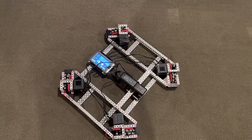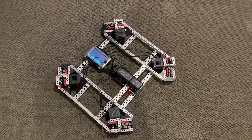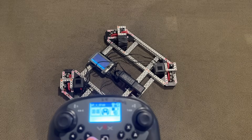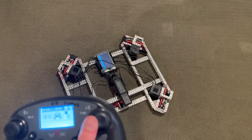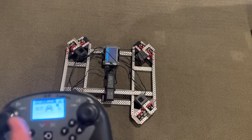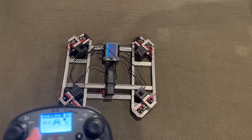You can also think about it as like an H-Drive, where those are going to be our strafing wheels. So if I go ahead and run this program, you can see when I move my stick forward, the drive just moves forwards and backwards. Whereas in my first program that would also move the drive base forwards and backwards, then turning — the other way I do it is that's just going to move me right and left. That's pretty standard for holonomic drives.